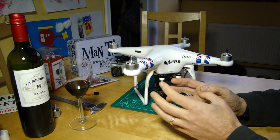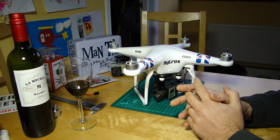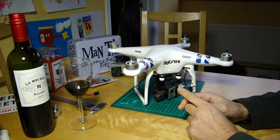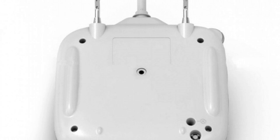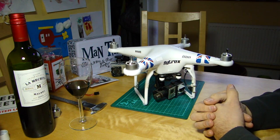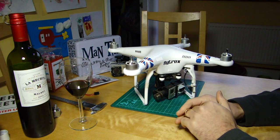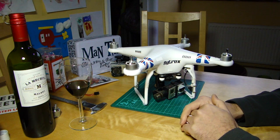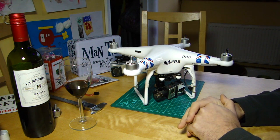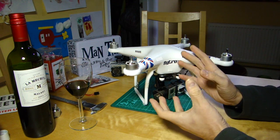However, I've had it confirmed by a couple of people running Lightbridge with their Phantoms that if you have the upgrade transmitter with the trainer port on the back - which is what you need to plug into the Lightbridge - when they plug that trainer port into the new DJI upgrade transmitters, it kills the RF output through the antennas. That means no interference issues, and if you have the upgrade transmitter you can plug straight in and use the existing setup with Lightbridge.